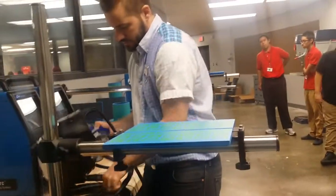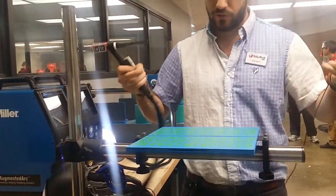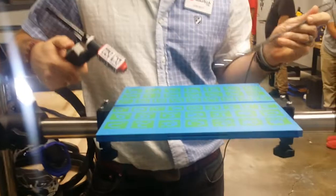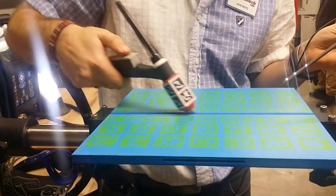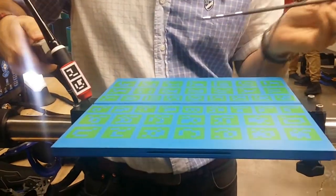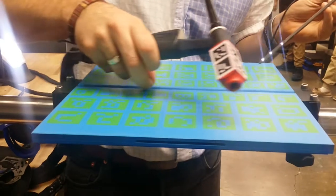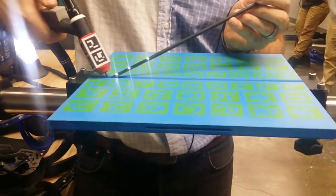Whenever you use this, you're going to hold it kind of like how drummers hold their sticks — like that. Then you're going to position it like this. This is your filler material. This creates the spark which will heat up and actually melt the metal together on its own. But when you have a little gap, you want to fill that gap with material. As you're welding, you're going to see those yellow lines — you want to make sure you put enough filler material to make those yellow lines full. You don't want to go outside of them and you don't want to stay inside; you want to touch them and stay inside.